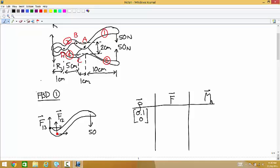There are no dimensions that say the height difference from the joint A to up there where that force is applied. But the reason that's not given is because you can move this 50 Newton force anywhere along its line of action, which means you could put it at a height of 50 meters, 1 meter, 0 meters. It's not going to change the problem. The Y position doesn't matter because of the direction of that force. Yeah.